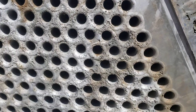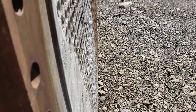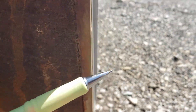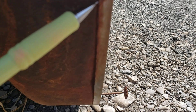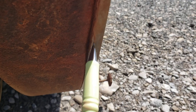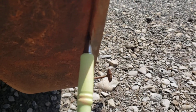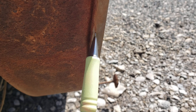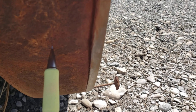What's interesting about this tube sheet — let me show the edge of it — this tube sheet has got a weld metal buildup on the face. Right here, it's actually corroded and separated the weld metal buildup from the carbon steel base metal.